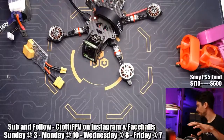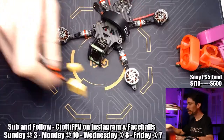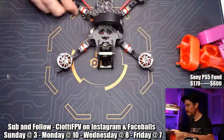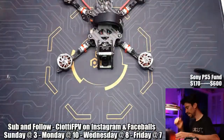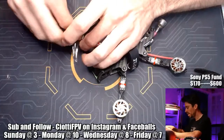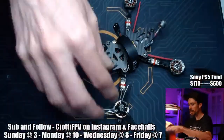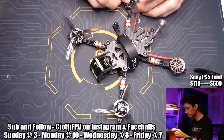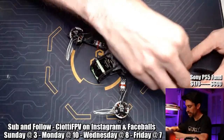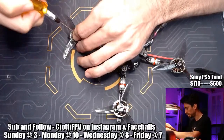All right, let's do a test hover. But in order to do that, we've got to put some propellers on. The propellers of choice are the Gem Fan 3520s. Especially now that I have a little bit more KV, these props are going to be fantastic. They're fantastic even on these motors at 3000 KV, but 3500 KV is going to be rocking. This thing is going to shred. So I'm probably going to have to move that motor limiting down a little bit, but I'll cross that bridge when I get there.